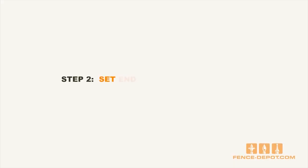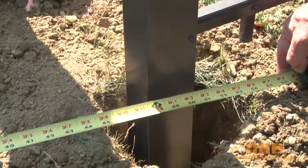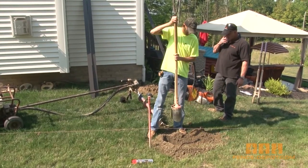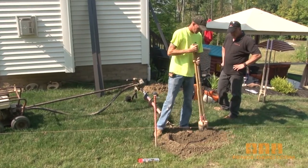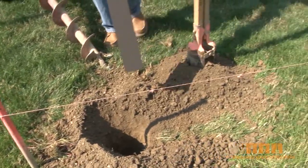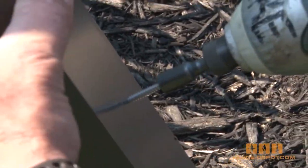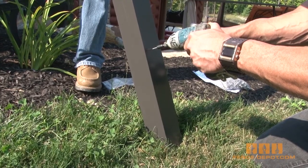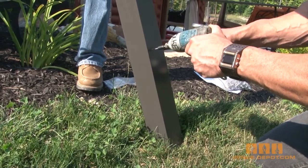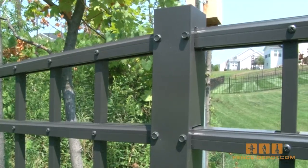The second step of the aluminum fence installation is setting the end, corner, and gate posts. Dig your holes at least six inches in diameter and two feet deep depending on the size of the post. Scoop loose dirt out of the hole and measure to check depth. If too shallow, keep digging. If too deep, add some loose gravel. Set the post in the hole and measure to assure proper depth. A great tip is to utilize a self-tapping screw partially screwed in at the bottom of your fence post. Once in the hole, it will allow the concrete to adhere to it and will keep your post from being raised during freezing, thawing, or wet conditions, keeping your fence perfectly level.